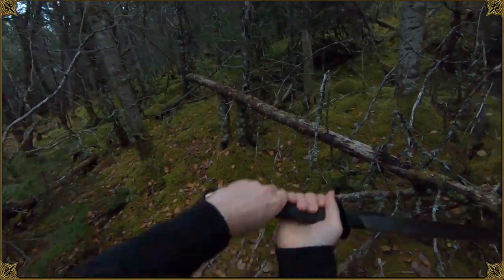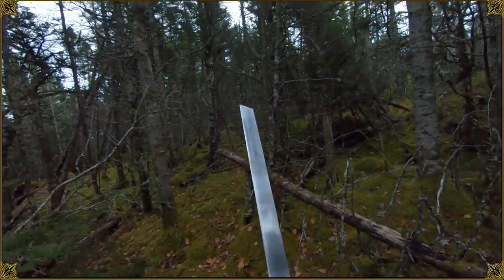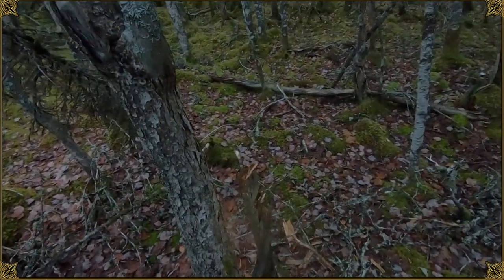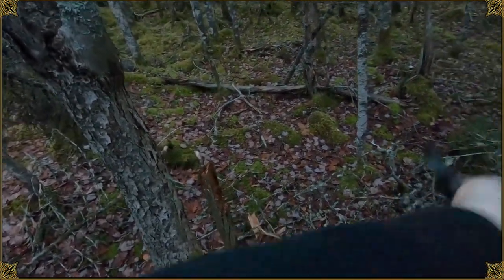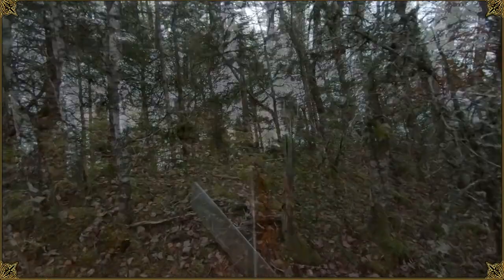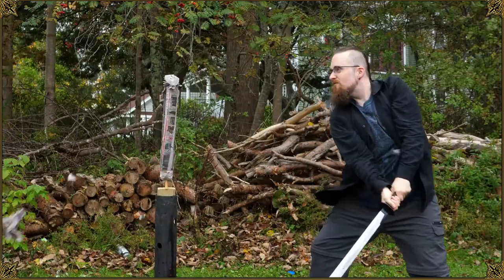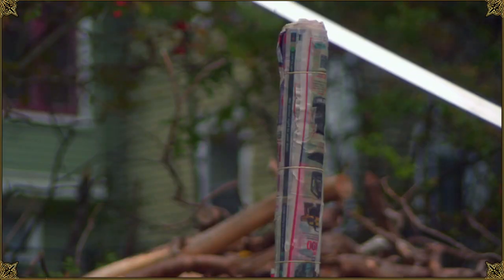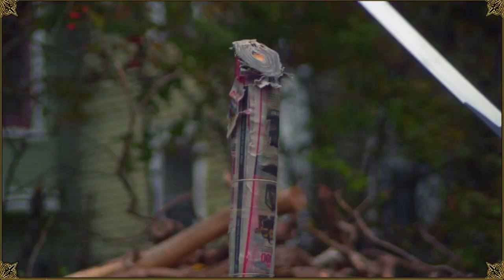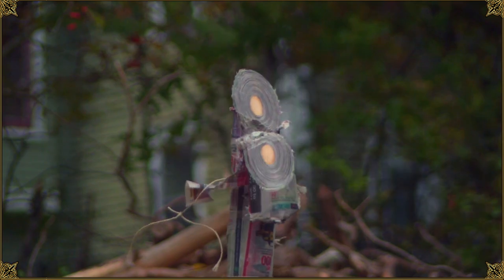The edge hasn't chipped or rolled from the testing, which makes sense because it's tempered to a hardness of HRC 56 to 58, which is quite hard. The alternative option is clay tempered T10 tungsten vanadium steel. With differential hardening you get an edge hardness of HRC 56 and a spine hardness of 40 to 45, so the edge is quite hard and the spine is softer for impact shock absorption. They say the spring steel option is actually safer for cutting, though the clay tempered one looks nicer. For cutting practice, I would recommend the harder mono-tempered version.